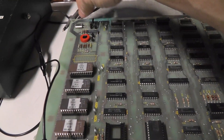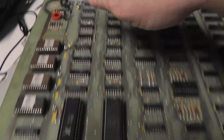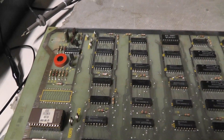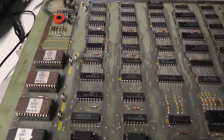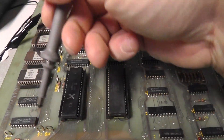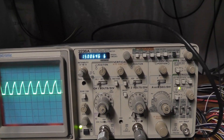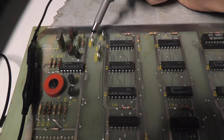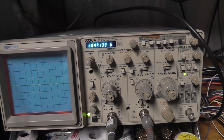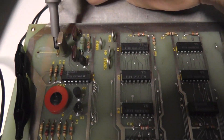I'm at least documenting what I get on a known-working board. Now switching back to the original repaired board with the replaced crystal — you can see it's working. I put a different CPU in while I got sidetracked. Measuring the clock: 1.50 megahertz with a little movement; 6 megahertz is rock solid; 12 megahertz is steady. And when I touch my probe to the crystal it again totally screws up the sync and I lose the picture.